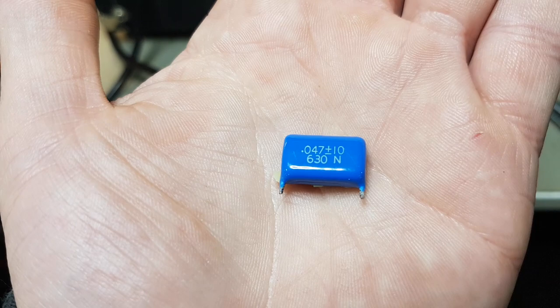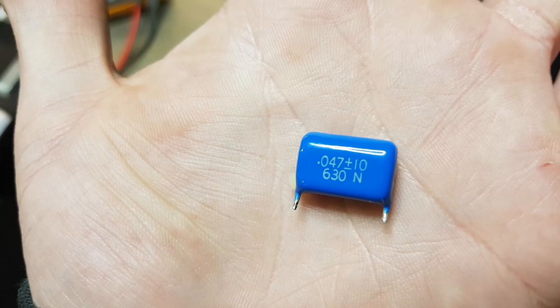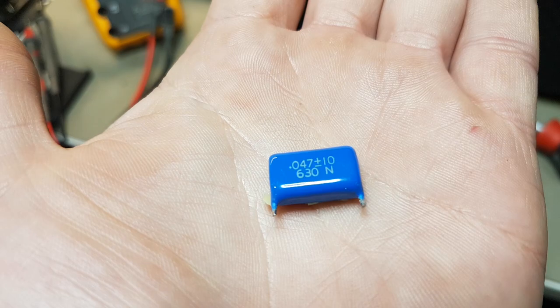Got you, you little bastard. That's the capacitor that couples the bias supply to the HT supply, and it's a dead short circuit - that was causing a short to ground. Hear that annoying beep? That means she's a dead short. We'll stick a new Panasonic in there.